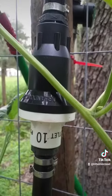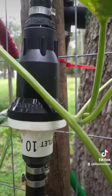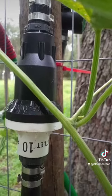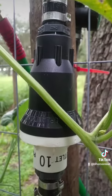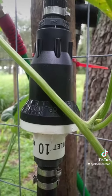Before we get to the wobbler head, we go through a pressure regulator that brings the pressure down to 10 PSI going to that head. That's the key with those wobbler heads — they don't take a lot of pressure, just 10 or 12 pounds. Some go to 15, but when you do that, you just get more diameter of spray, not so much volume.